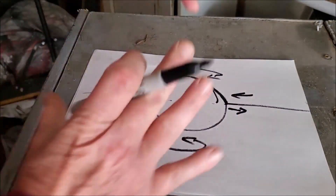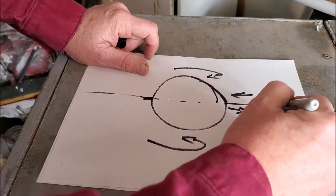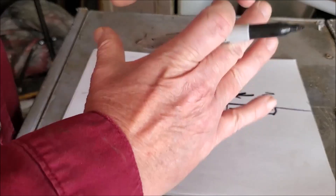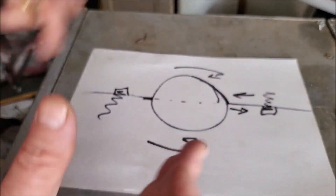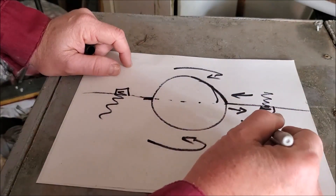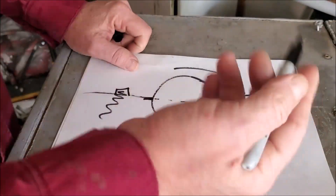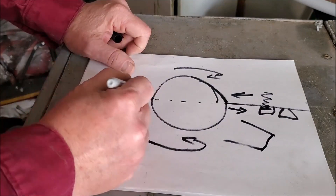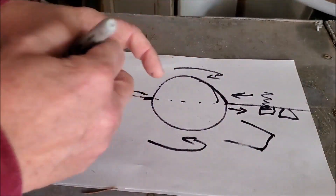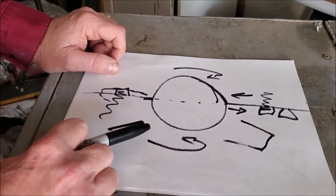The way to get around offset and torque are keys. Keys can be cut in — here's a piece of the upper mold and here's a key that's a piece of the lower mold — these keys lock the mold halves together so you cannot get offset or torsion. There are several types: a wedge-shaped key, interlocking keys shaped to snap together (for soft molds only), a raised key around the entire circumference, or the easiest ones which are almost like eraser heads — they lock in, don't move, and are very easy to create.